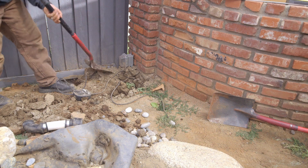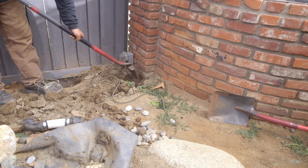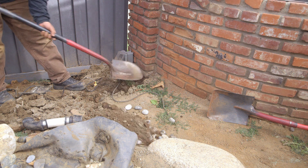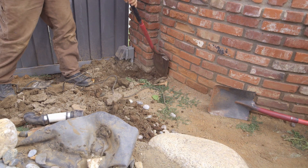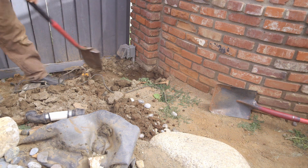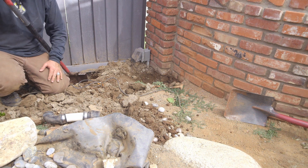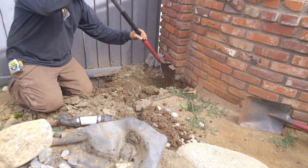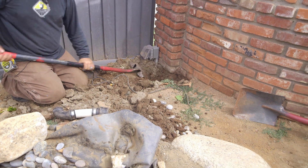I definitely don't like dirt this close to an electrical box. This electrical box would have been better served maybe a couple of inches taller — I usually like to get them off the ground at least a foot, maybe 18 inches. This brick is beautiful and it's a shame to cover it. Without running a laser level, I can't give an exact number, but there's definitely too much dirt here and too close to the electrical.